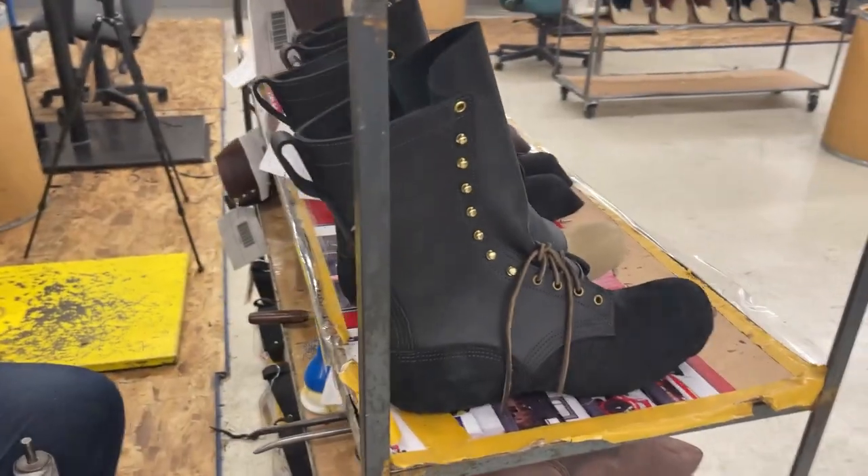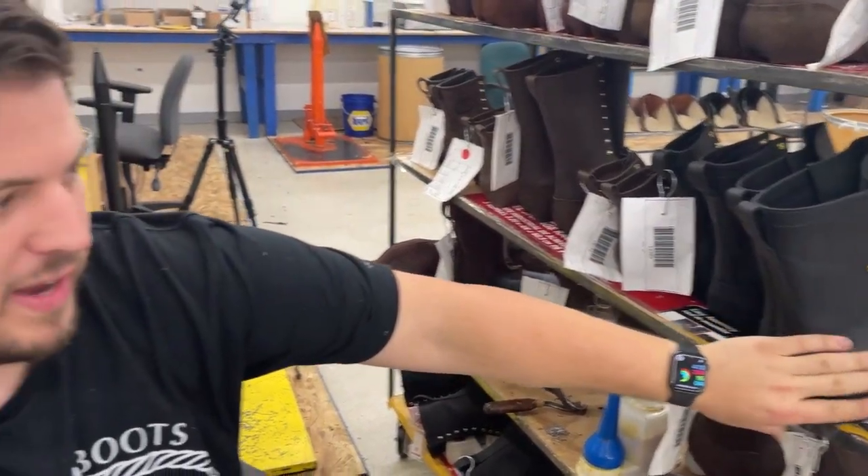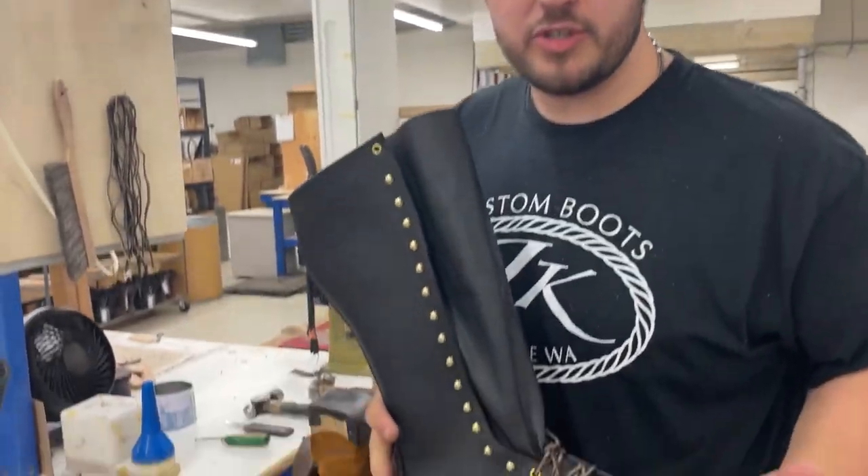What's the next step? We're going to shank the boot — it's called — and bottom it. So we're going to build up the arch, build up the lineman shank, bottom the boot, and we'll see how all that's done on the inside. We're going to open it all back up. Technically, if I had just done this, I would wait probably like two days before opening it up so it can take that form and shape and really dry around the mold before we start working on it — that way it's going to hold its form over years to come.